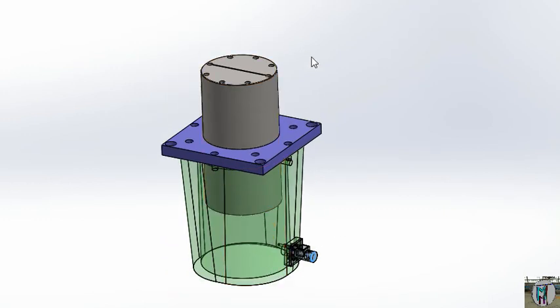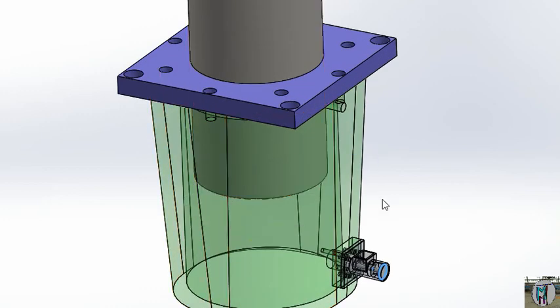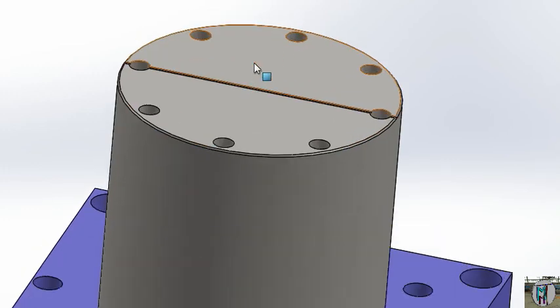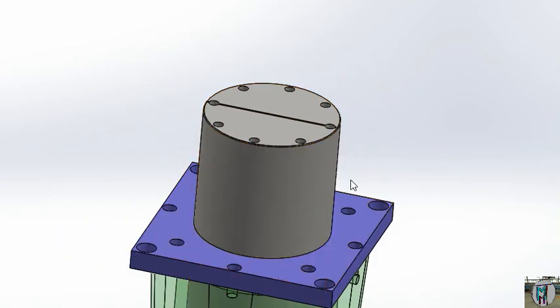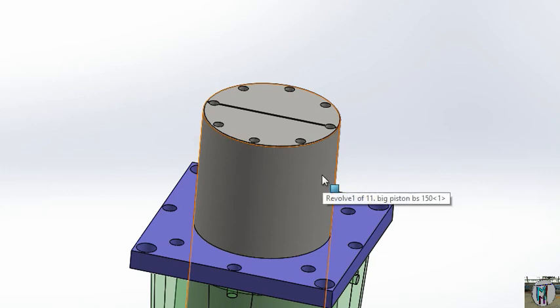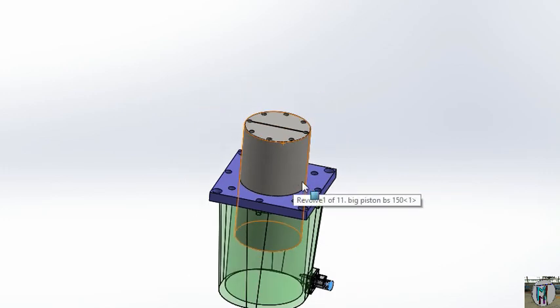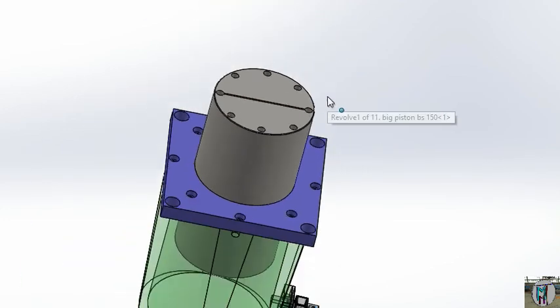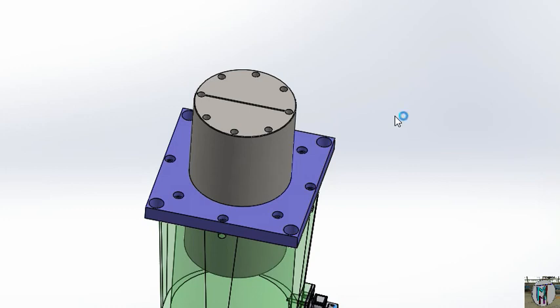What is the reason that we make this big cylinder? If your force cylinder area will be more, so force will be built there — more force — because when you will inject some items in your mould, you need more pressure. Suppose 110 pressure is there, and if this diameter is very short — suppose 150 mm — we put this, so the press will not close at that pressure size, which is around 500 into 500. That time it will not work, and only pressure will be at the bottom only 50 mm. So if we go with this type of piston, pressure will come to this point, and this is closed with the full pressure of your hydraulic oil. So we need — if our cylinder piston OD is very more — we are taking the big cylinder so it will take more force.